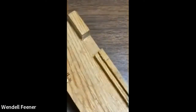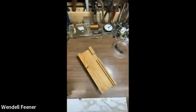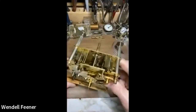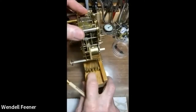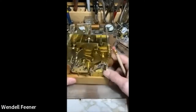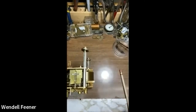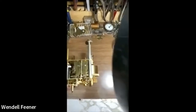I have a little wooden stand made because these movements with hammers on the bottom need a place to sit so the hammers are free. It's homemade — you can make something similar because if you don't have one it's hard to watch the hammers actually work. Now let's check how well the strike and chimes work before we take it apart, because it's always a good idea to verify things are working properly before disassembly — it can save you a lot of grief down the road.